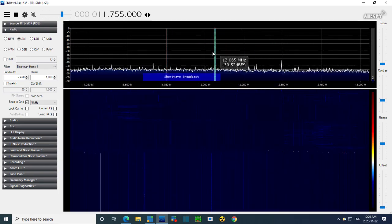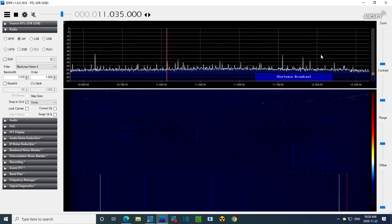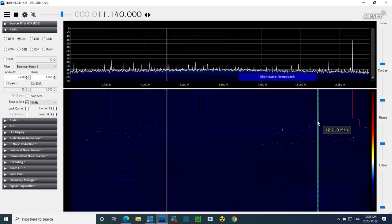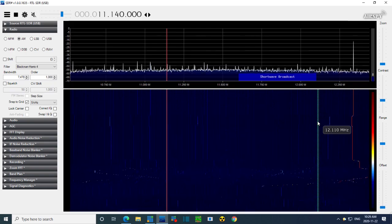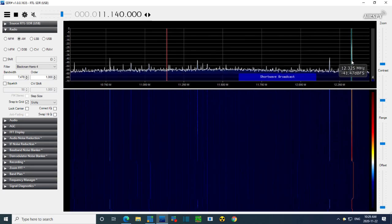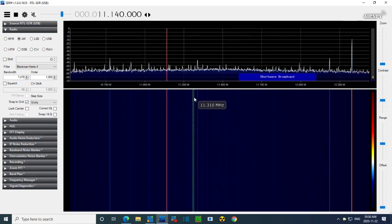Yeah, lots of problems with using the SDR for this kind of stuff. Look at that, eh? So, I'm going to tune the radio a touch. You see that jump around? The bigger one with the red trace. Tune down, it goes down also. You know what that means? That means that's a significant signal there. If you could get a significant signal in from the antenna at around this frequency, 460 away, it's going to come out of the speaker regardless of the fact that you're on the 9 megahertz band. That would be a little confusing.